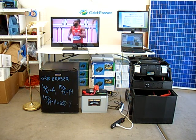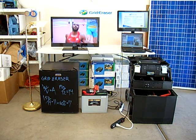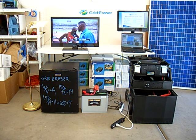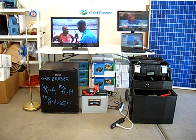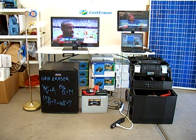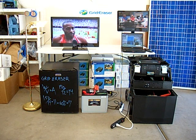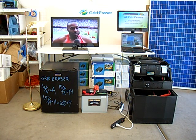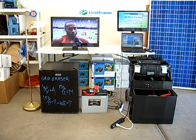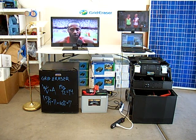So 60% times 11 equals 7 hours of runtime with a battery that's discharged to 50 to 60% — a significant amount of time for this type of solar system at this price range. That surprisingly high run time can even be extended a couple of ways. During sun hours, keep the solar panel connected when powering your electrical components, and it will handle 200 watts of load without taking any battery capacity, leaving a fully charged battery for use at night. Or double the run time by changing out the discharged battery with a fully charged second battery — it only takes seconds, literally seconds. You can view that short video on battery change-out on our website.